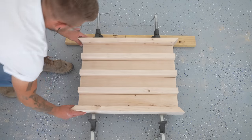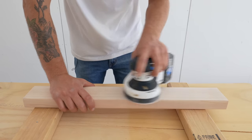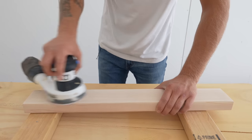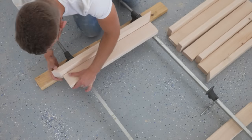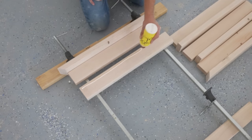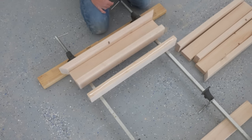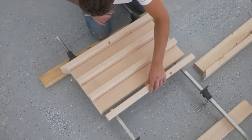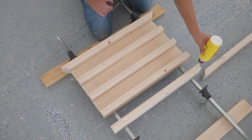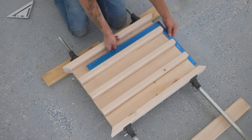After I knew my top and bottom plate were a good fit, I sanded down all of my individual pieces to remove labels and clean them up to 150 grit while they were still accessible. My typical approach to a glue-up is to use as much glue as possible for a strong joint, but for this project I tried to channel my inner Chris Salamone from Four Eyes Furniture and get as little squeeze out as possible. The rounded edges on the two by fours and inside corners make cleaning up squeeze out really difficult.